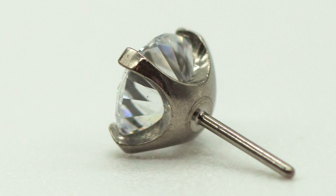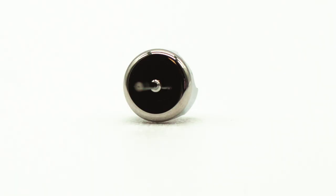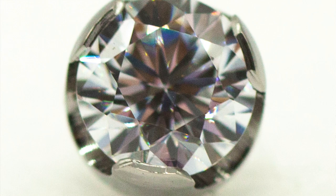Once again, it is no comparison — there is just a massive difference that we can easily see under magnification. The Invictus piece is just not polished. And if we take a look at some more comparisons on that setting, it hurts me to look at these prongs from the side. They are so tall, so chunky on the stone, and just not well set down. I would be worried about a client losing the stone out of this piece much more than out of the Anatometal piece, which has bigger, more secure prongs pressed down a little bit tighter to the stone.